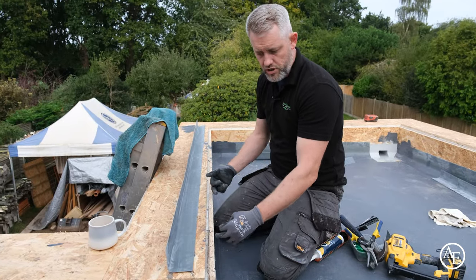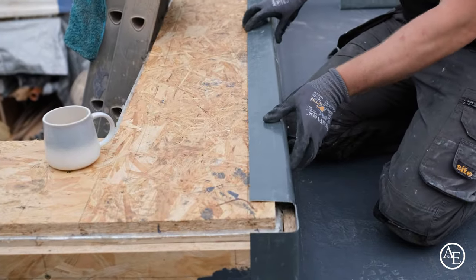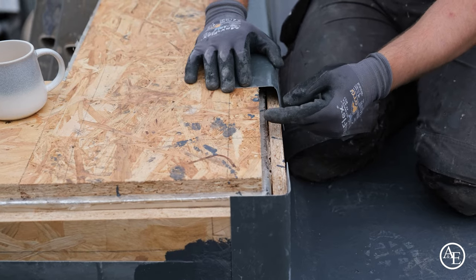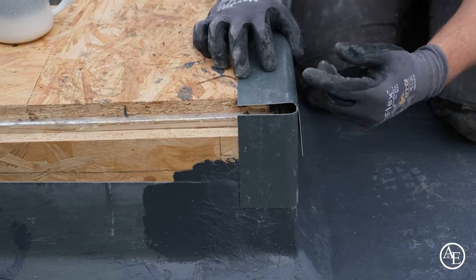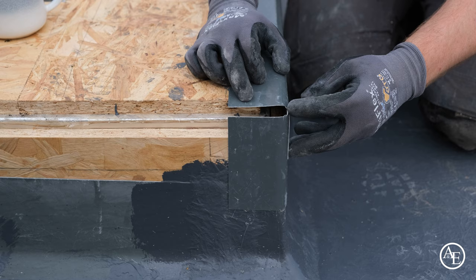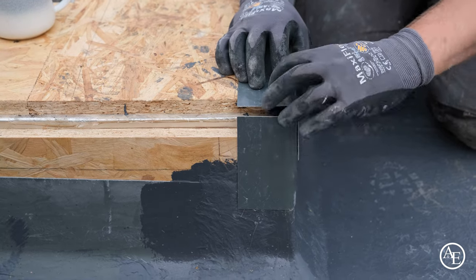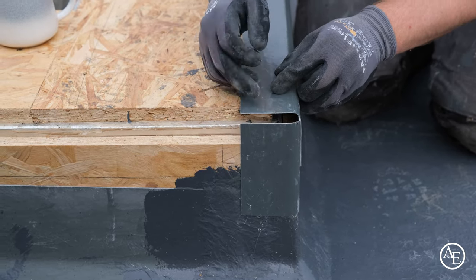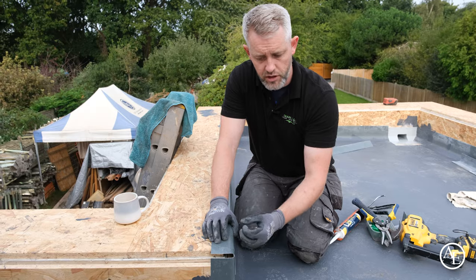We're now starting the upper edge trim. We're going to have aluminium cappings on this, so we want a nice waterproof tight seal. We've stepped the face board down and stepped the top board back to incorporate the radius edge. I tend to step this back slightly, and when I set the next trim on this 90-degree I'll also step that back and let the fibreglass form that corner — you get the round off this edge, the round off the actual corner itself, and the round off the trim. The fibreglass will mould around all of that, giving double lamination at that corner edge for extra strength.